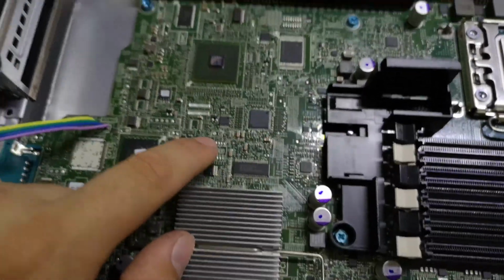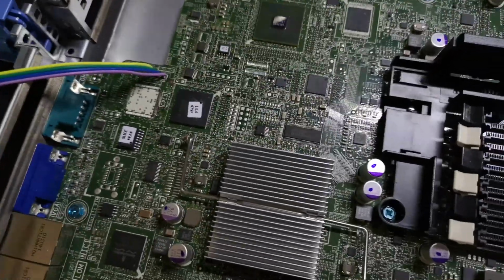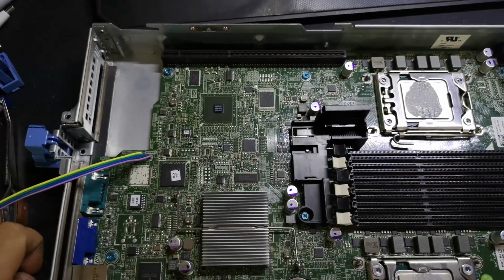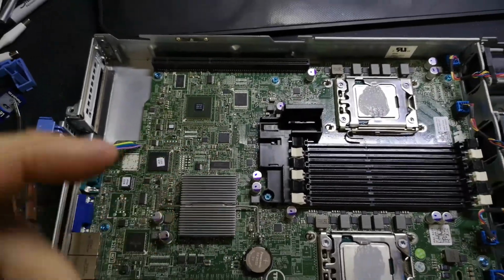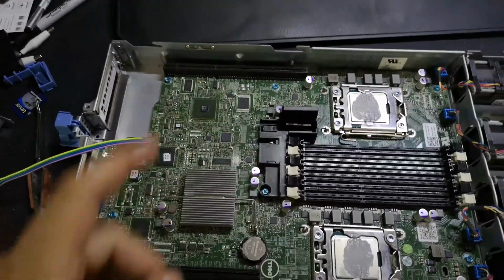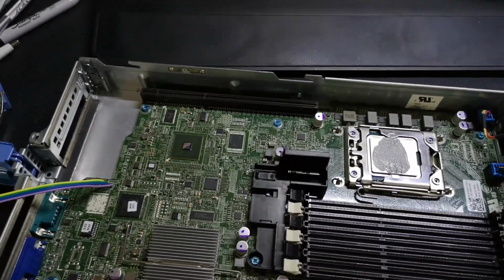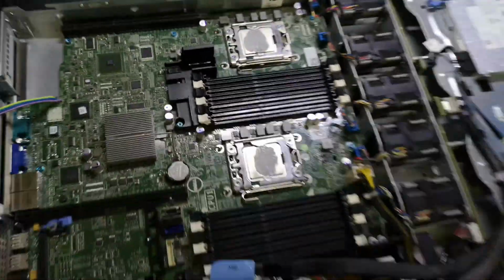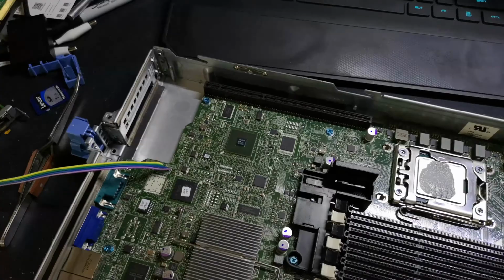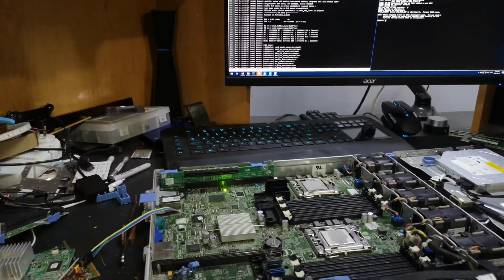I don't think I have any switches to put in there. I'll have a look. But apparently maybe only the first 3 or 4 are connected, so I might have one somewhere, one of those little board level things. But that might be a way to interrupt that U-boot process and then reprogram the eMMC. Although it doesn't look like those guys made any progress really. But as you can see, I started half taking it apart, but it seems like there's not really much point getting to the other side of the motherboard. Okay, shit, I wish I had been filming.